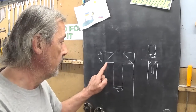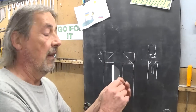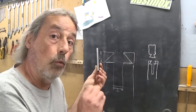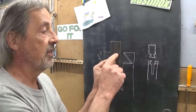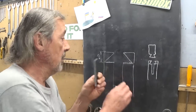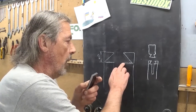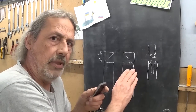And on the other side also. So 2, the width, 2, 2 — together that makes 6. This part is almost 8 millimetres, which means the thickness left here and here will be less than 1 millimetre. Imagine this is not really centered because these surfaces are not finished yet. So 45 degrees is maybe not a good idea. I will try it at 30 degrees. And at 30 degrees it is 1.15 millimetre wide instead of 2. I think this will be better.